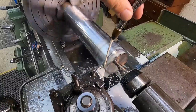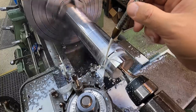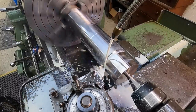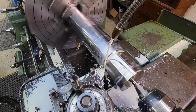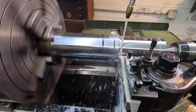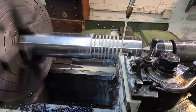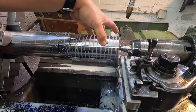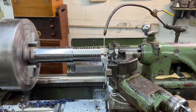Nothing to it — it's doing great. The machine handles 300 thousandths just fine. We only have about an inch to take off, so I figured I'd take three cuts of 300 thousandths and that'll leave us 100 thousandths to finish with the other tool bit. That first pass did great removing 300 thousandths — it handled it just fine. I know it can handle more, but let's do three passes at 300 thousandths and get it down quickly.